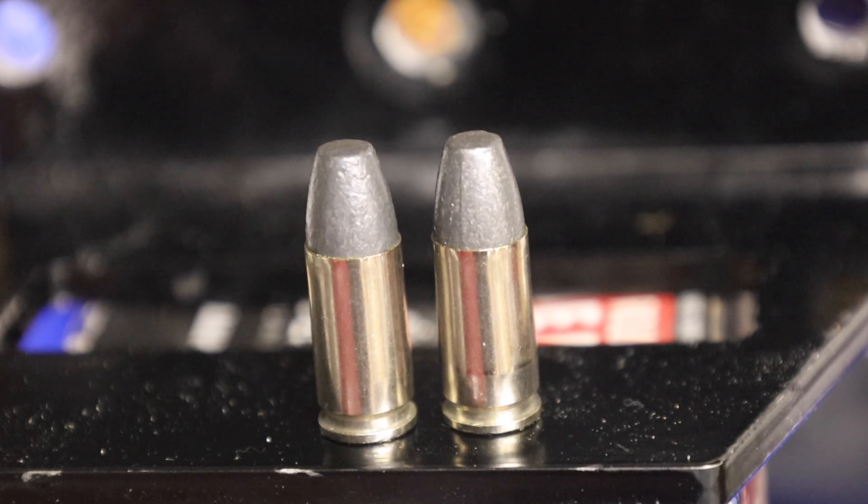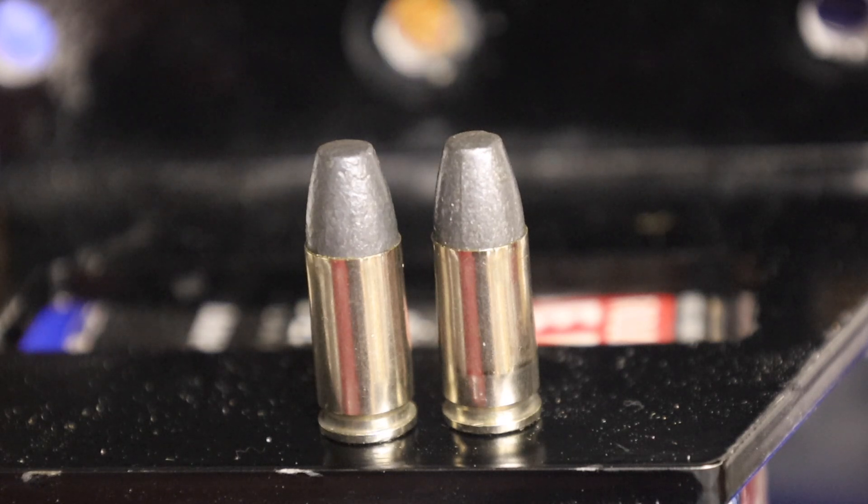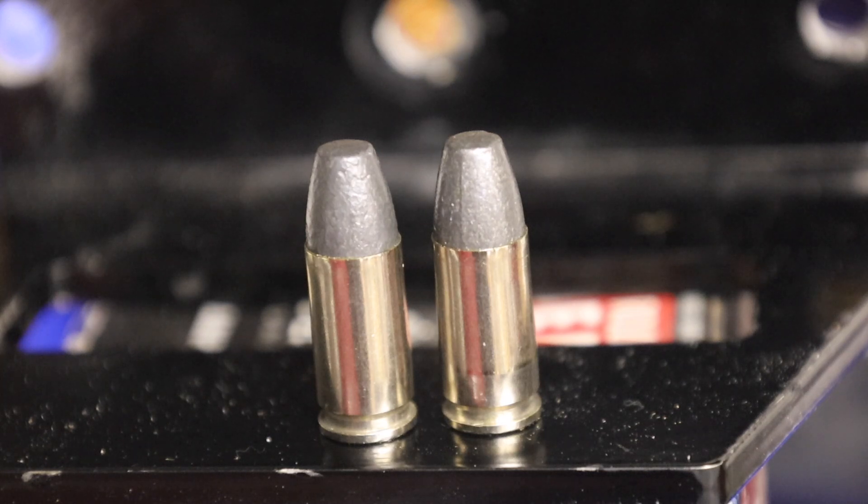The reading is 0.329 on the micrometer. So we can reproduce that crimp if we have a nice load with low standard deviation — we can reproduce this crimp at any time, especially with a locking breech lock ring, and the same shell holder, the same press. We're in business. Because we're using this hack with the nine millimeter and it's straight up — no change needed. The micrometer bullet seating stem turns your factory crimp die into a micrometer crimping die. How's that for a hack? And you saw it here first. Bye for now.